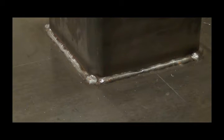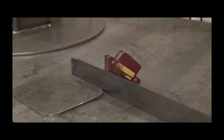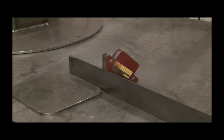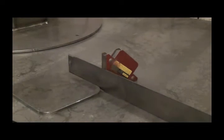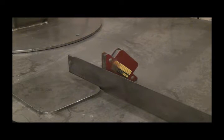I'm not really sure how to go about this. I know that this plate is — I believe it's five and five-eighths square — which will give me enough room that I can tack weld this on the inside and it won't interfere with fitting on the lid. I need to turn the welder down to handle 16 gauge so I don't just blast through it. Let's see how this works here.